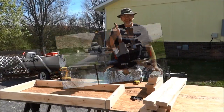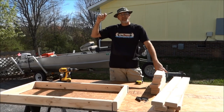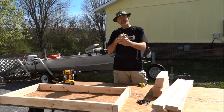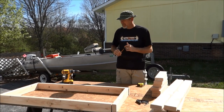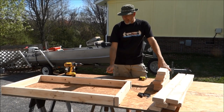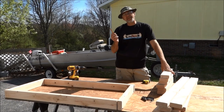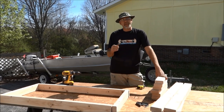We basically are making an eight-foot tall shelf that's gonna be four feet wide and two feet deep. It's pretty particular for where we're gonna put it. In order to do that, I went ahead and cut eight 46-and-a-half-inch two-by-fours — 46 and a half inches is just an inch and a half short of 48 inches, to compensate for the thickness of the two-by-four.